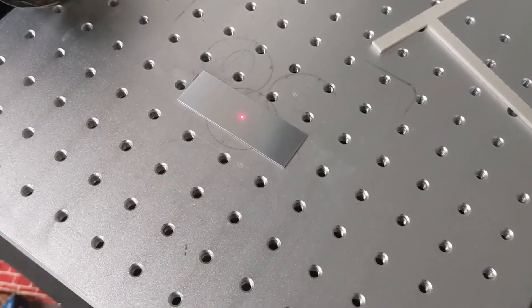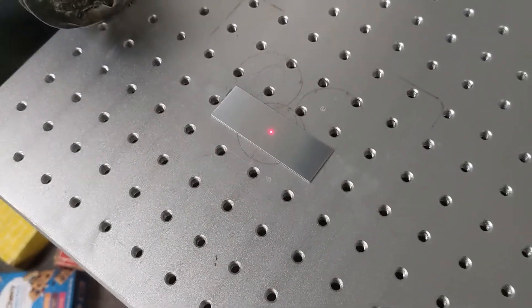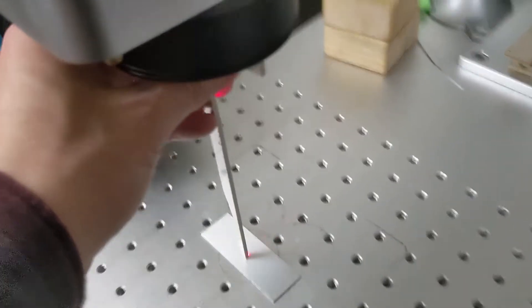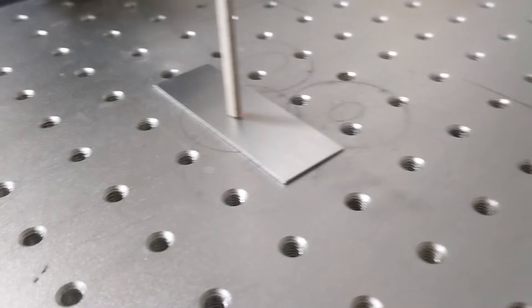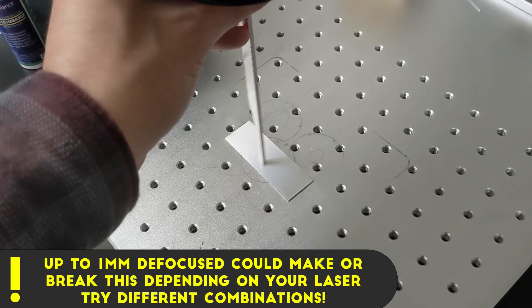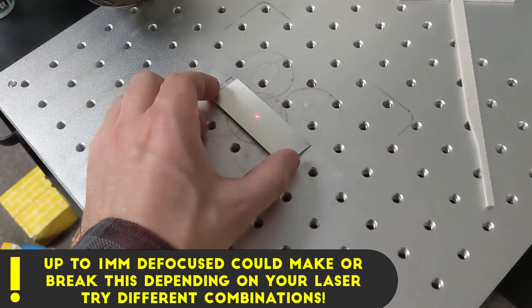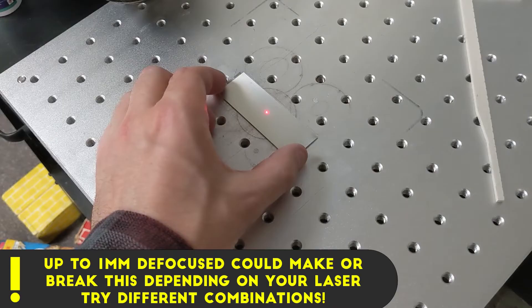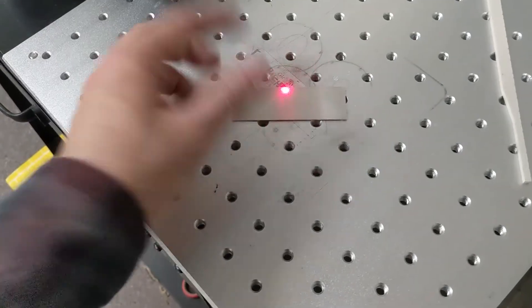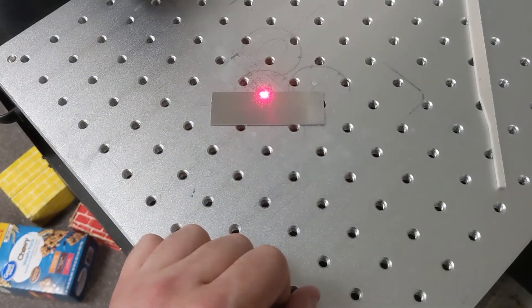I did just want to point out that my plate changes a couple times during this video, because I actually had a little bit of a hard time getting it to mark. I changed my focus — now when I focus, we are actually hovering just above the plate. That little bit of difference from my normal focus, instead of having it just barely touch the plate, made the difference. That is about where you want your focus to be: just a touch higher than perfect. So if you're struggling to get this to work, try that, because that may solve the issue for you.